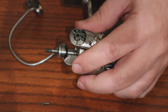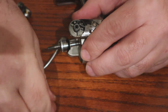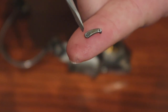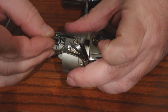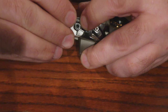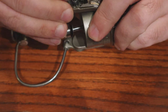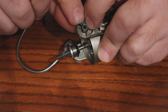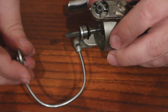Make sure that the flat side is facing down — might have to wiggle that around a little bit. Now that you have that in place, there are two ends to this cam piece right here. You see that there's a skinny end and a fat end. The fat end is going to go up to the top, and the skinny end is going to go down to the bottom, closest to the spring. So you put that little nipple into the holding spot on top of the spring and just push it down in there. As you can see, that slid underneath this piece right here. And if it was working, that's how it would be situated — but it's not, and I have that piece on order.